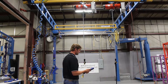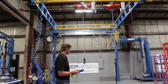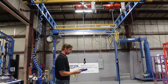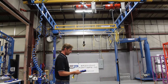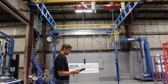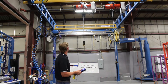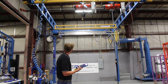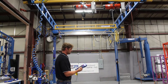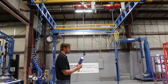Now I'll save and exit. I'm going to start this unit up and I should be able to operate this hoist. I'll take it down and put it at the same starting point. I'm going to set this low point right here, then run it up and set a medium point, then go all the way up and set the high point. Going back to low — notice I'm not pressing any buttons. The hoist knows exactly the low position I just set because of the encoder.